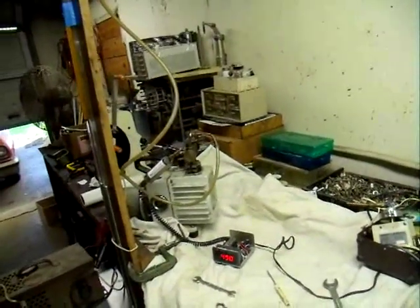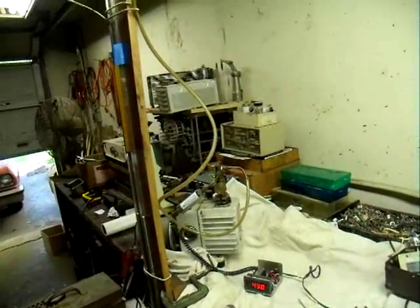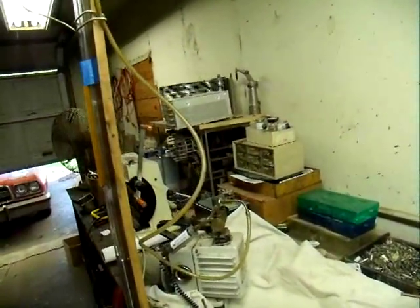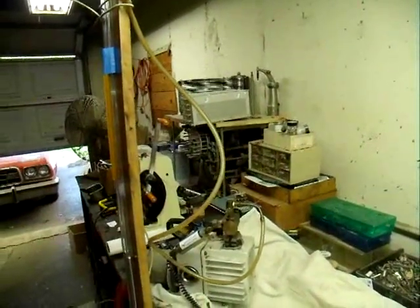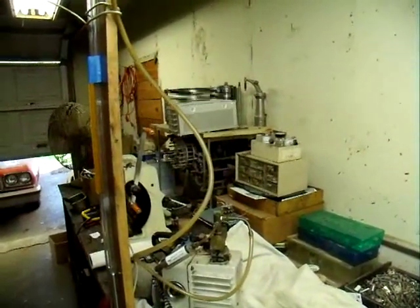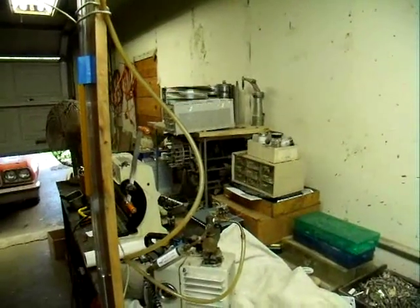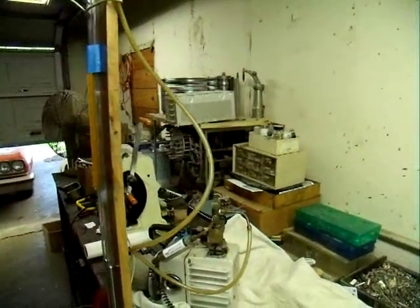This session we're going to calibrate a capacitance manometer for use with making Nixie tubes. If you have high vacuum gauges for making vacuum tubes, all of the gauges run out of range when you get up into the pressures used when making Nixie tubes. Typically, 100 microns is the maximum you would ever use with a vacuum tube. You might go up to 1 torr if you're making a gas tube, but going up into the 10, 20, 30 torr range — you don't ever do that in vacuum tubes.